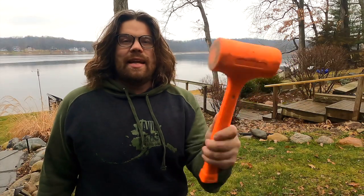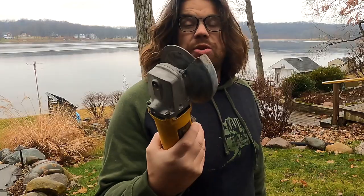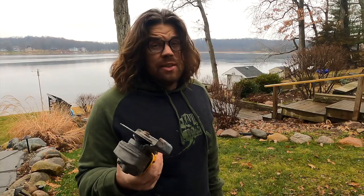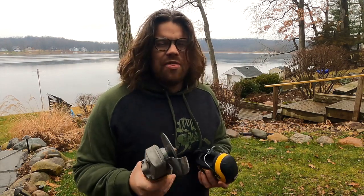Next are the masonry hammer and a dead blow hammer. The dead blow hammer is very important — it has sand in it, so when you hit it pushes force down on whatever you're hitting. It's great when tapping to set stone down into the base. The masonry hammer is a must — you need it for chipping, cutting, and pretty much everything. Sometimes I also resort to a hand grinder with a diamond cutting blade. The trick is to go back and knock the edges so it doesn't look too clean — you want an organic look. Always use eye and ear protection with the angle grinder.